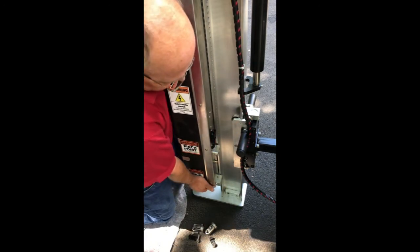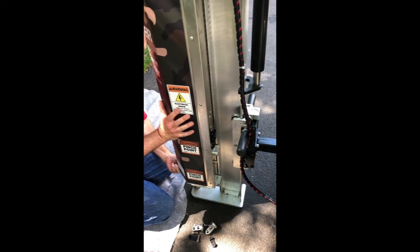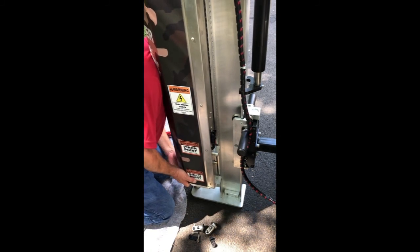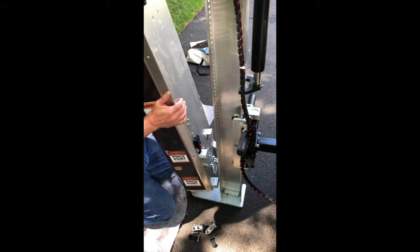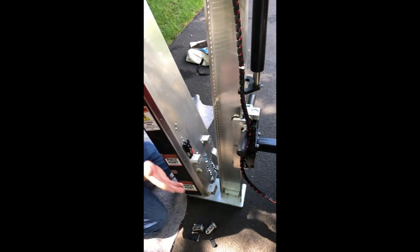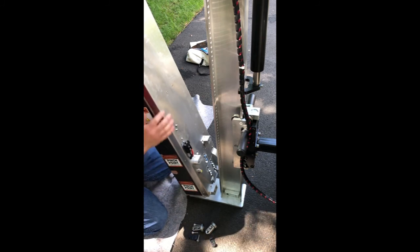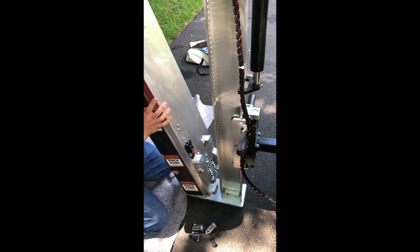Sometimes you have to give it a little lift up to disengage the gears. You can unlock the hammer to free it up if needed — unlocking the hammer with no power isn't going to hurt anything. It's really meant for transport to keep the hammer from bouncing around. If you have power and the anvil goes up into the body of the sapper, it will activate and start a test, which is quite jarring without a drive rod in the ground.